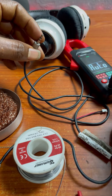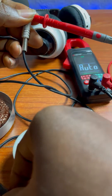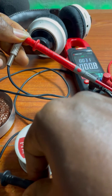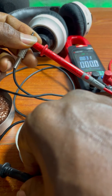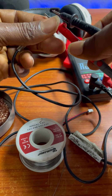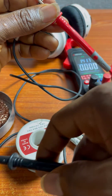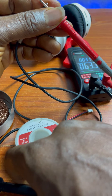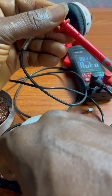After everything, I opened it up and tested it with a multimeter. The first one — the negative — went through. I tried the next one, the right audio, and that was working. But when I tried the left audio, it wasn't giving me a continuity reading — I could see some resistance, which means it could talk but won't work properly. So the little fix has turned into a bigger fix.